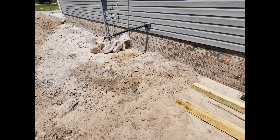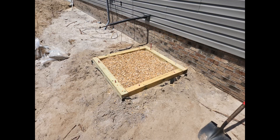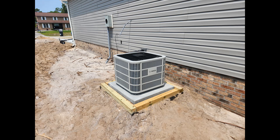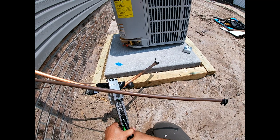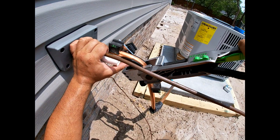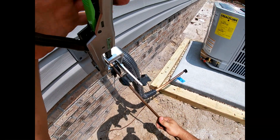I had a lot of fun installing my heat pump condenser. It was being installed on sand, but I wanted to go a step further to avoid any erosion problems. So I cut some 4x4s, laid some pea gravel down, and then set my concrete foam pad to make a really nice level surface for the condenser to sit on. Next, it was time to make some more bends. I slid my condenser out of the way and marked where I needed my piping to end up with some blue tape, so I had plenty of room to work. I used my Hilmor benders with the reverse die to easily make those bends.